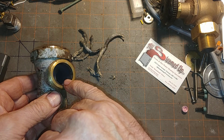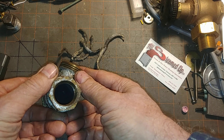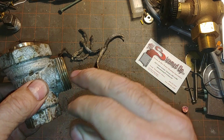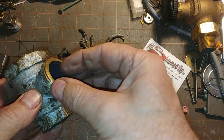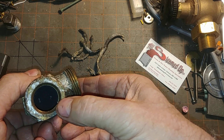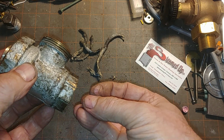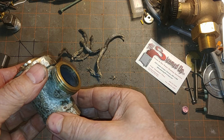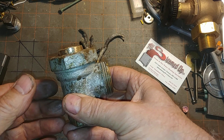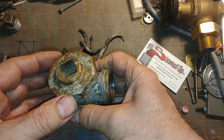You can see that it is partly open. There's a cylinder on the inside. This is the part that goes into the radiator with the spud, which is missing. And this is the three-quarter inch female national pipe thread connection, which is the steam supply. In this system there is a return, which is at the bottom of the radiator, usually half an inch, and it's just an ordinary elbow.